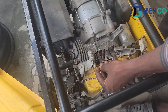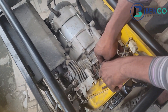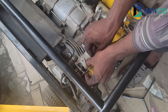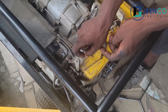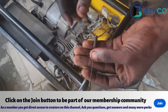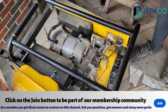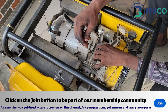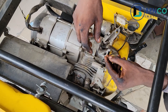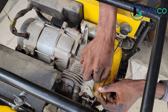If you look carefully you would observe the governor spring is broken. This is one thing that happens — when the governor spring is broken, your generator can never have the required speed needed to provide the required voltage for your appliances. What you will observe is that your generator sound is low, the speed is low, and it equally affects the voltage. So instead of getting an output of 220 volts or thereabouts, you could be getting something like 110 volts.